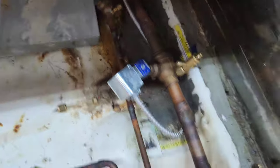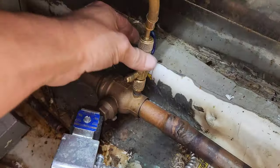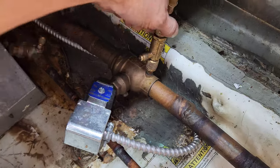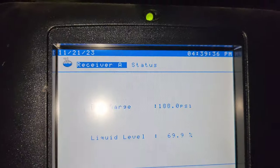Good to have tools that work. Don't forget to purge your hose. So let's see what starts happening after 30 pounds. We should see discharge pressure go up, so we're going to watch that. Looks like the discharge is starting to go up some. I don't know why they have a target of 143 — that's ridiculous.